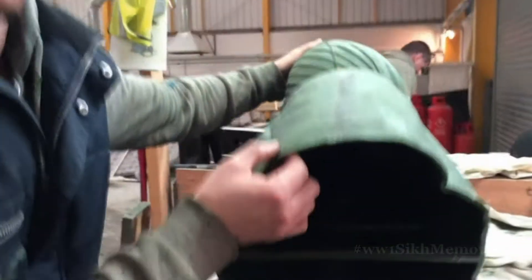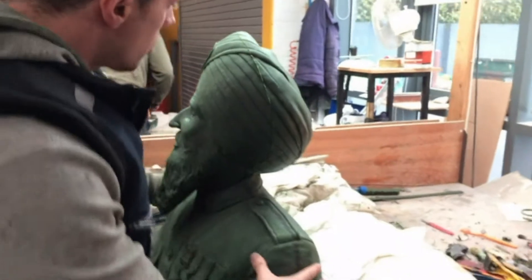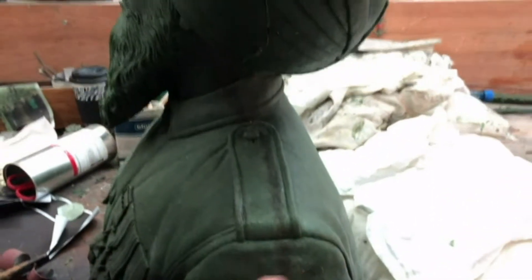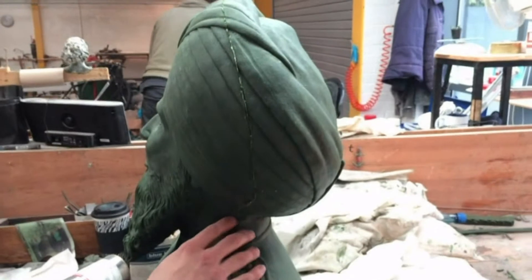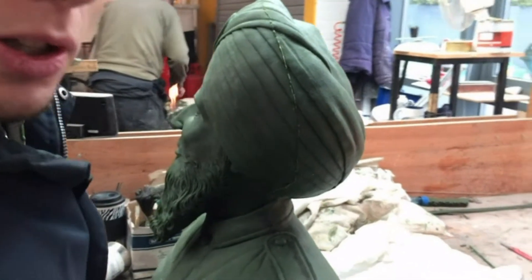This will be the actual thickness that the metal should be. You'll see here that when it comes out of the mould, you've got a seam line. As a wax moulder, our job will be to take this seam line out — and you'll see here some of it's already done. You're trying to put back in the artist's detail, the artist's surface texture, as best you can, so that when this is cast, it looks like it's a seamless object.